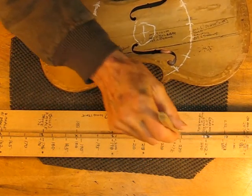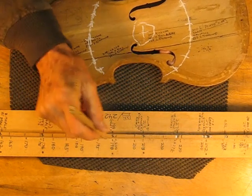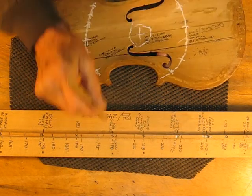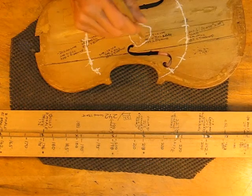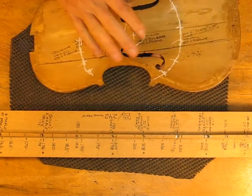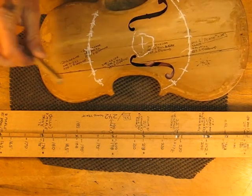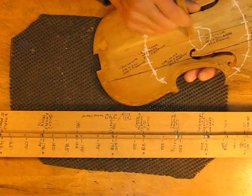It starts going up, then down, down, down. It stops moving — it just stays similar. It goes up. It's right at that transition between tones being the same, going up, and going down. So basically we're at 198 Hz. For a top plate, we'd like it to be 213 Hz. Let's examine the high one and see where it is — that's the average.